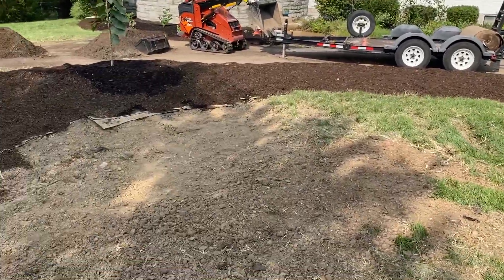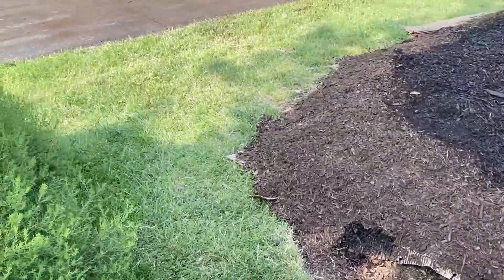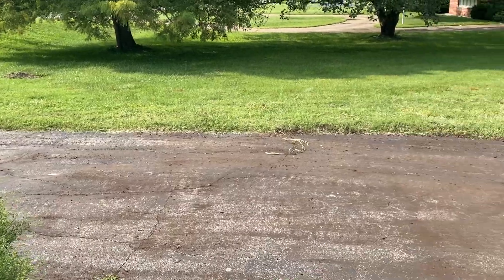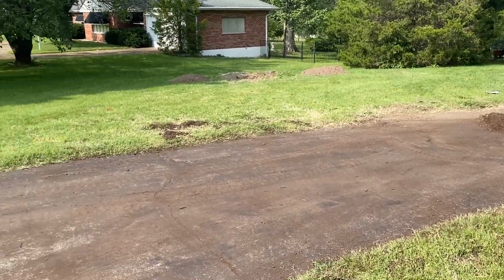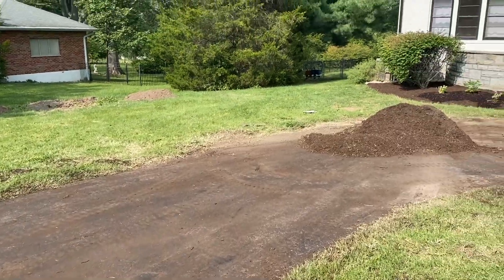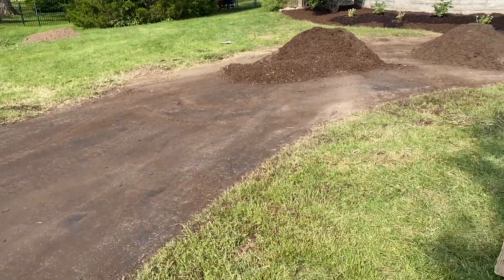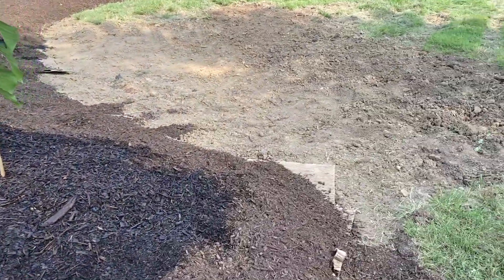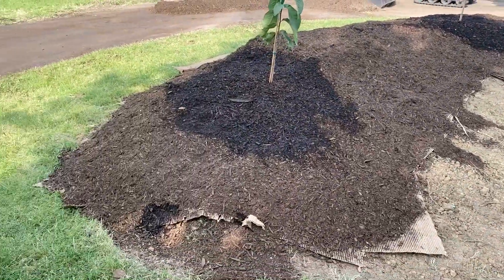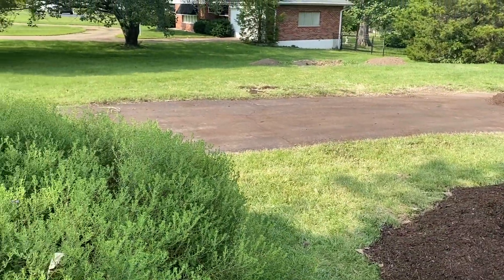We're pretty confident that the system will work and water will fill and infiltrate. Should there be any excess, it will exit right here, go over the driveway, and then tomorrow we're going to build our two berms there. It'll hit those two berms, spread and sink a little bit more, before finally heading to the backyard where it can be dealt with in a fine way. No sewers impacted.